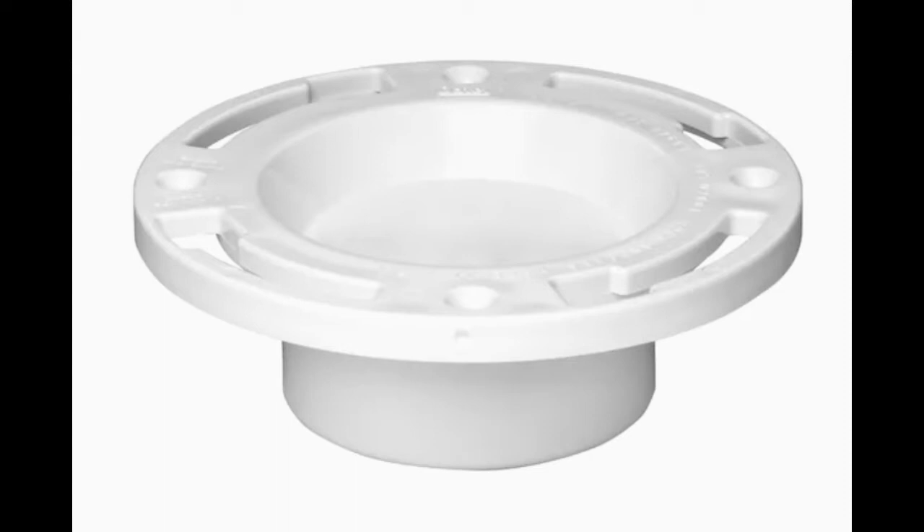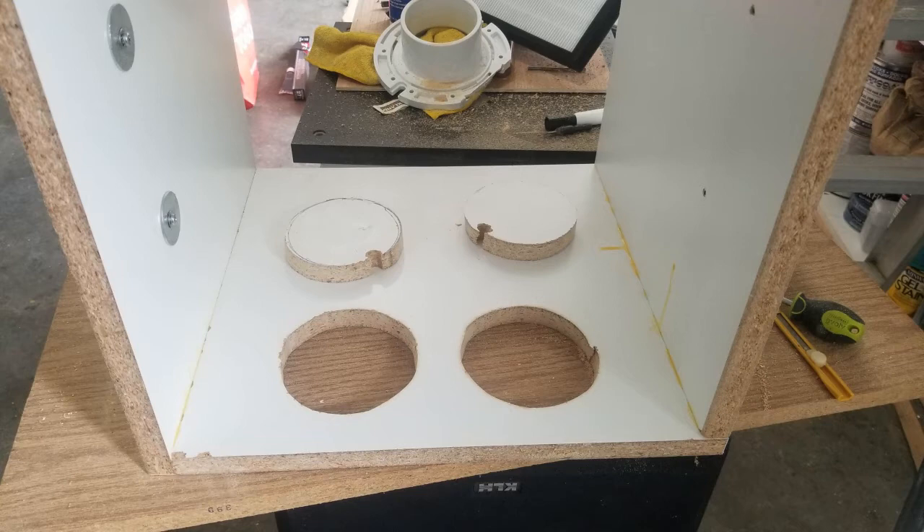For the fan box — the topmost box — I decided to create two circular output vents so I could attach them to the window vent. I found an incredible solution at the local home improvement store: plastic toilet flanges with a four-inch outside diameter, which is standard for vents, costing only around four dollars each. I cut five-inch diameter holes in the side of the box and attached these flanges to the holes, also adding drawer handles with washers on two sides.